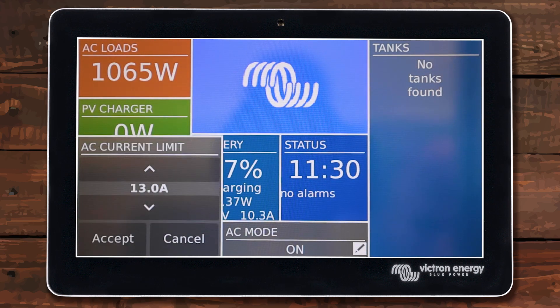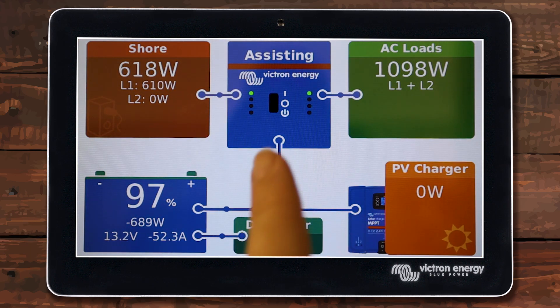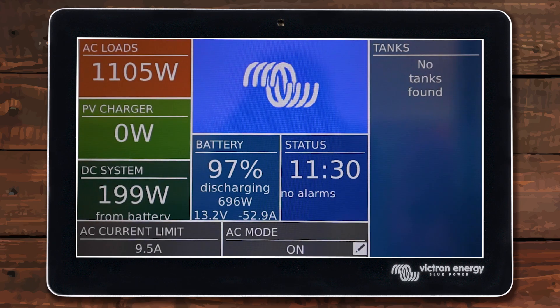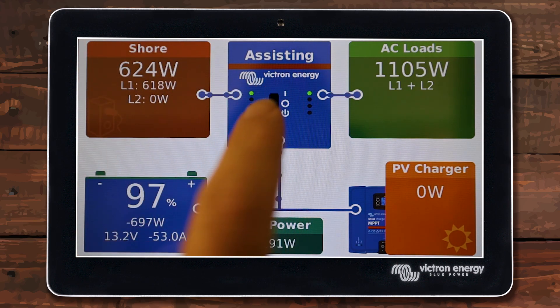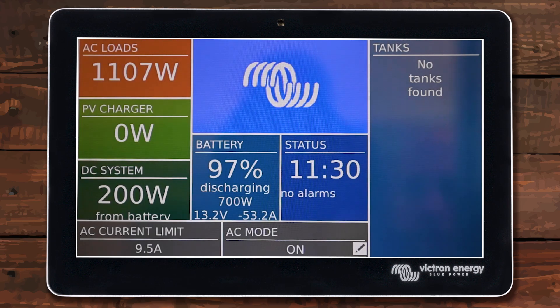We have the proper size rated cord to be able to do this. I'm going to turn this current limit down so you can see what happens — if we don't have enough power coming in and we're using too much, the inverter goes into assisting mode. You can see it's lowered the power coming in because we set the current limit lower. Now it is actually helping the shore power — assisting it. Power is coming from the shore and pulling some from the batteries; we're losing about 50 amps or 700 watts going up to the air conditioner. That's what assisting mode looks like.